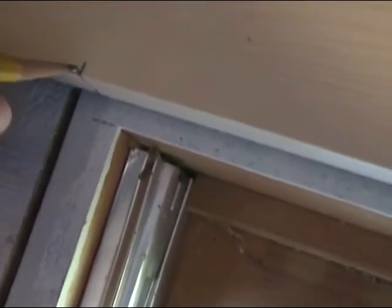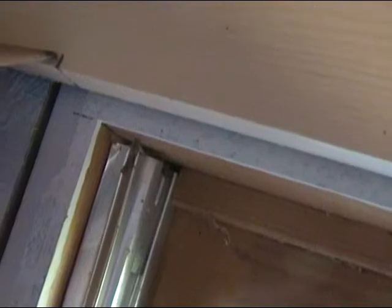And we'll go out here on the miter saw and we'll actually go by the edge of this mark and we'll cut it. We'll 45 it out this way right here. And then this piece will be ready to be nailed up. So I'm gonna go 45 it and nail it up, and then we'll start with the bottom piece.